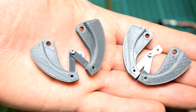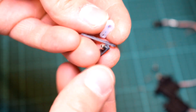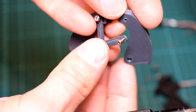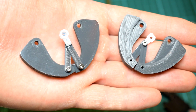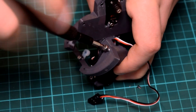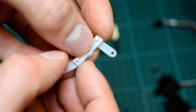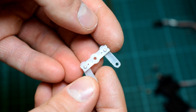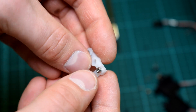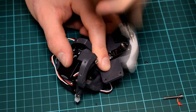The next step is to construct the arms. Using a servo horn cut down to only two holes, attach two long link components on the furthest hole from the center and screw it in. Take an opposing pair of arm components and screw the long links to them on the flat sides — check the images to make sure everything goes together right, and leave it loose enough to move freely. Make two of these sub-assemblies and screw them to the base using 10mm M3 screws in the big hole on each arm. Then construct the linkage for the top servo: using a two-sided servo horn cut down to two holes per side, attach a short link on the outermost holes and screw upwards through the bottom, leaving it loose enough to move freely using 4mm M2 screws. Another two 4mm M2 screws go into the short links the opposite way to connect to the rocker component. You can also attach the rocker component to the top of the base with a 20mm M3 screw.